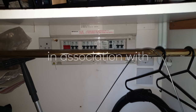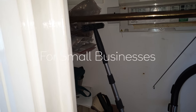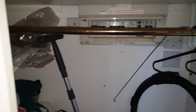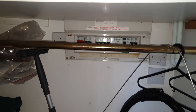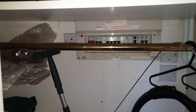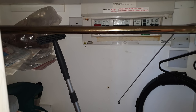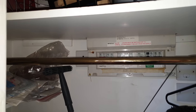That's the fuse board there, all this stuff's in the way. So you're saying all the stuff the electrician says you need to do - it's a genuine fuse board, it's a new build, but this is the old building. If you're fitting a new one it's got to be metal. All that detail given on the estimate should be on the certificate, because that should match up with all the remedial work he's saying on this estimate. I've got the RCBO here for the lights that will cover the bathroom, so that'd be one thing.